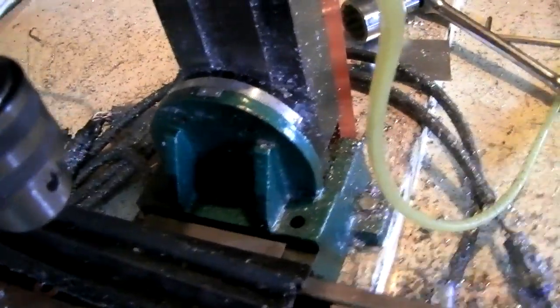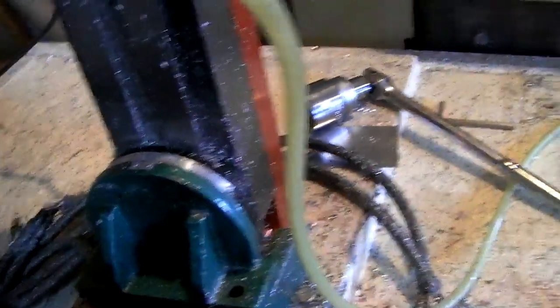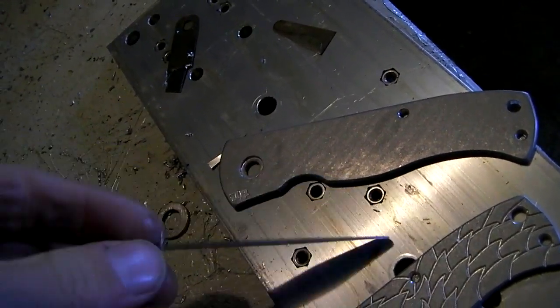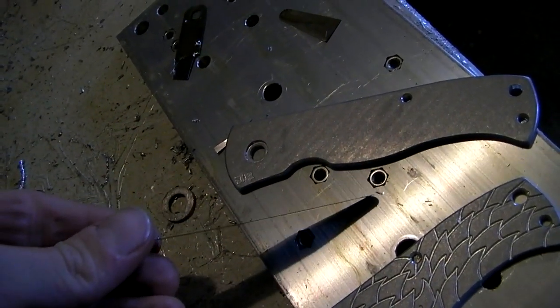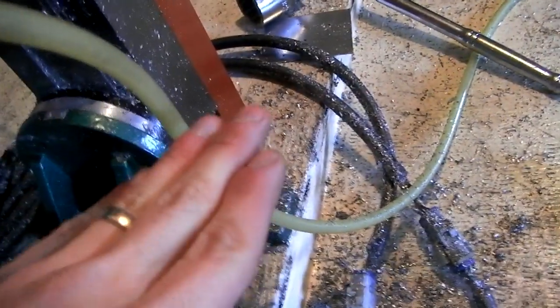You see it bolts with three bolts right there, and I've got them loose right now. So I can take the machine and move this whole thing. What I'm going to do is add little shims. A shim is this — seven thousandths of an inch thick. For reference, a human hair is roughly about three thousandths of an inch, so this is super thin. I think the magic number will be four thousandths. I've cut it up into little chunks — one there, one there, and one over in the corner — a four thousandths shim under each bolt at the leading edge of that plate, so that when it's bolted down it'll move up four thousandths.